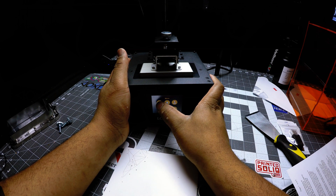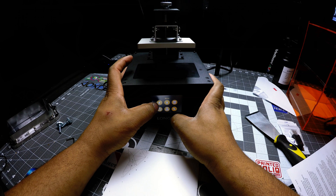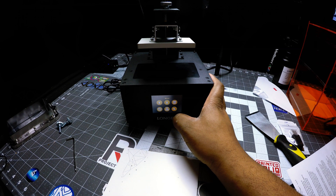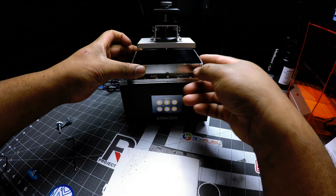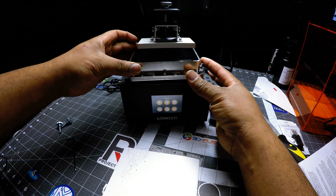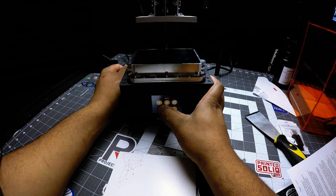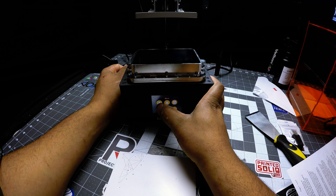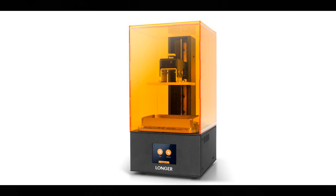You can go in and plug in your printer and power it on. Go through the menu and you can adjust the bed in one-millimeter or ten-millimeter increments. Raise it up high enough to fit your tank inside, place it on, and screw it down with the two bolts that come with it. Raise the tank high enough where you can pour the UV resin in comfortably. Then let's make our way to the computer to install the software and load files onto the flash drive.